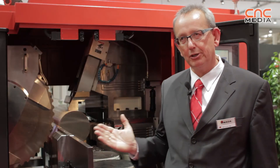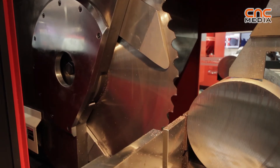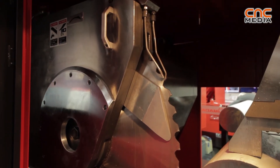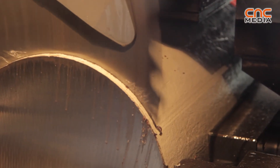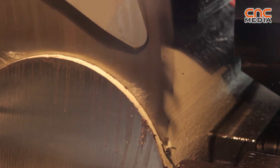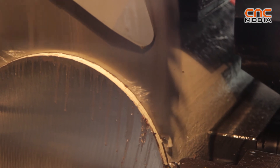Deformation was always a problem in the forging industry, as material had to be de-stressed after shearing. With the circular saw blade we can avoid this. On the other hand, we have a more economical procedure by not using coolant — the only thing we use here is air plus oil mist, so the heat is taken away by the chips.